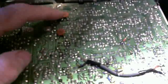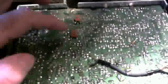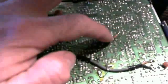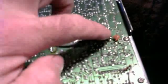Okay, let's take a quick look inside. So far, like I said, all I've done is the receive conversion. I've started on the transmit, but it's not finished. The 2 disc capacitors is what I'm using to resonate the first stage receive, going up to the receive mixer. There's a resistor here added over to the AGC circuit. Another disc capacitor, same point, right there on the transmit receive mixer transformer coil. That's where our signal is generated from. It goes to our receive mixer and transmit mixer.